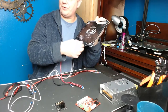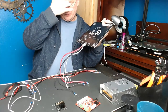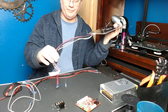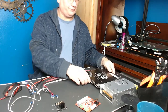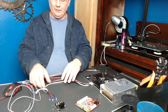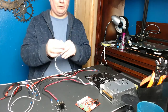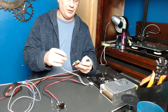That's how I did it originally. I didn't melt my connector — I melted my wires. Anyway, that's hooked up. Now off of there you're going to have a little white wire right here. See this little white wire? This goes in the BT connection on your motherboard.